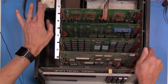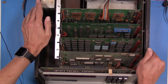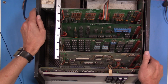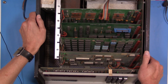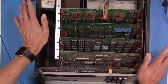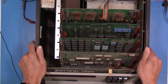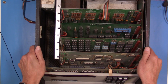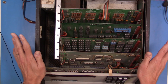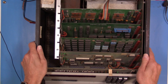I'm probably going to try bringing it up very slowly, plugging it into a variac and over many hours or even several days just slowly bringing the power up to see if we can reform any capacitors. There's a big massive capacitor under the cover in the back, and it'd be nice to save that if possible, but if we have to do work on it that's just fine.